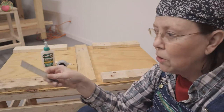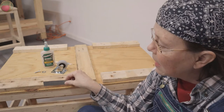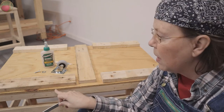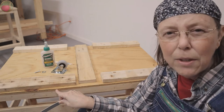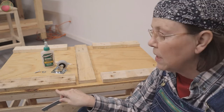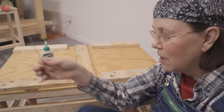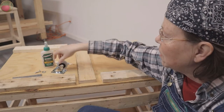And then while the glue is drying, I'm going to use 1¼-inch brad nails, and that's going to go all the way through this board and just into not even quite half of this plywood. For that, it's really just going to tack it more than anything, but it definitely won't come all the way through because we don't want puppy paws getting pricked by those nails, right?